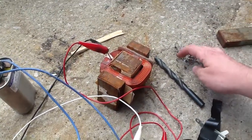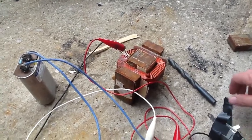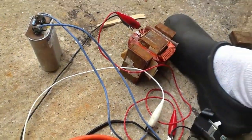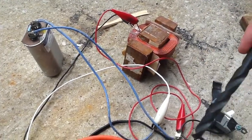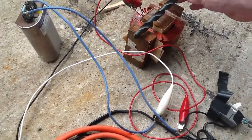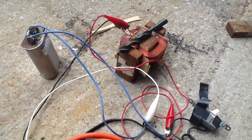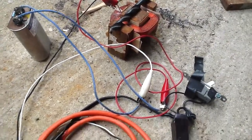I've got some chips here — turnings from my drilling operation — as a test. Right now the drill bit is still magnetized; it's still attracting the stuff. So it's just a capacitor in series with the primary. Here in the US it's 120 volts, though that doesn't really matter as long as your transformer winding is sized appropriately for whatever mains you have in your country. So you just put the drill bit on there and turn on the power.